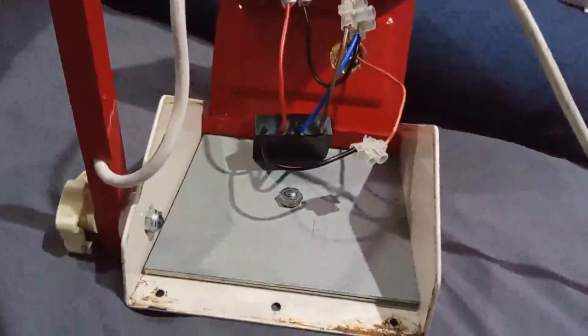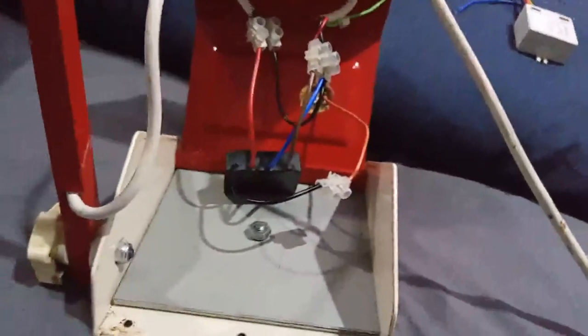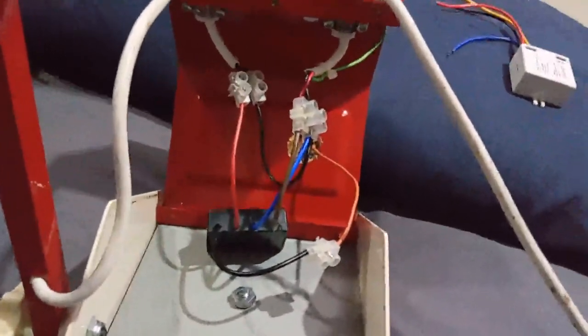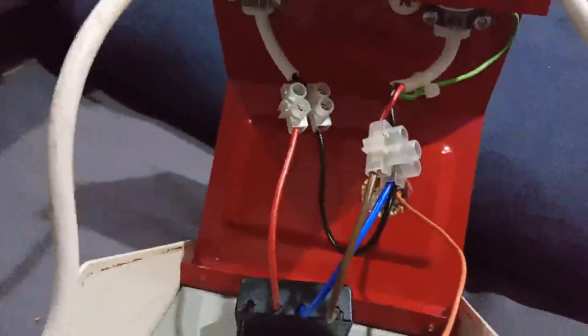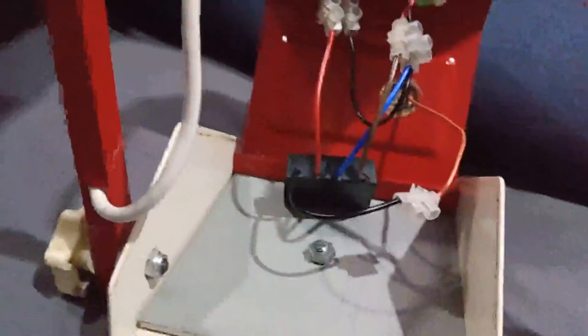That's just an on/off switch — you can get one that dims to three levels by touching the pad multiple times and it goes around in a circle, but I couldn't find any suitable for my lamp at 230 volts New Zealand voltage 50 hertz. It's all working now. The red one goes off to the light side, black wire going to blue which is neutral, and brown going into the box, and the black one going off to the touch lamp — which originally was orange. I put those chocolate blocks on to make it easy to repair every time. Lucky I can do these repairs myself.